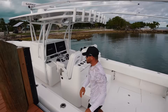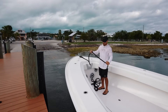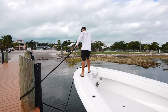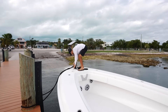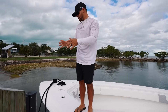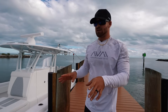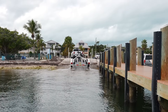The same thing we did in the rear we're just going to come up here in the bow and do the same exact thing. Whenever you guys are buying dock lines for your boat, try to get long dock lines — I think these ones here are around 35 feet. What's great about that is you can take this line, throw it over a piling, and come right back to your boat and tie off on the cleat. That's probably one of the best ways to tie your boat because if the dock weren't here, it would allow the boat to rise and fall with the tide since the line is not fixed — it can go up and down.